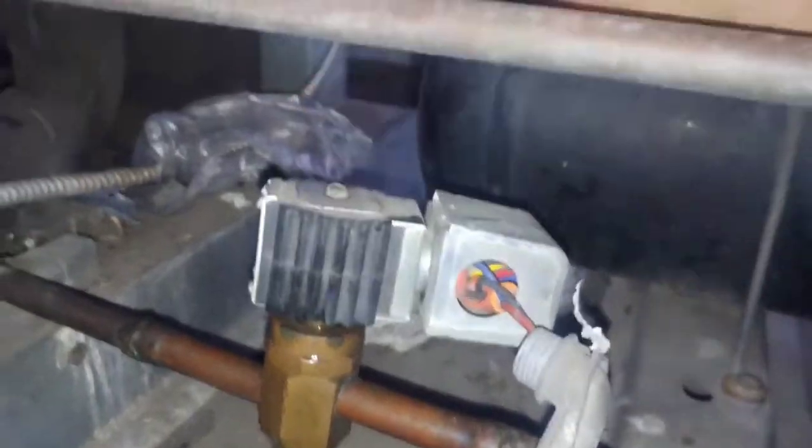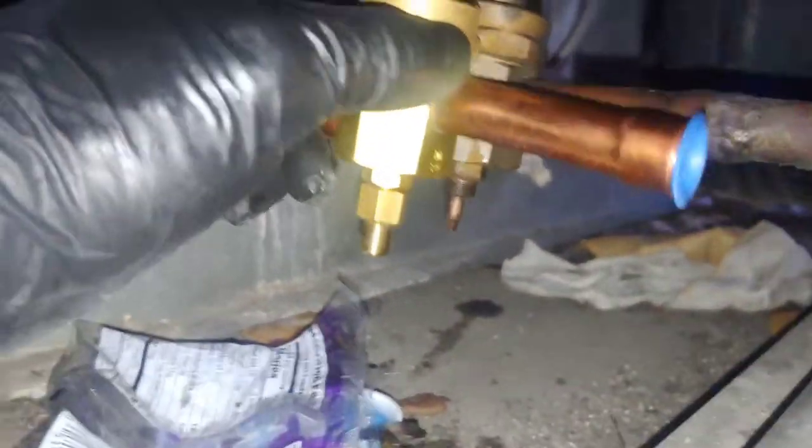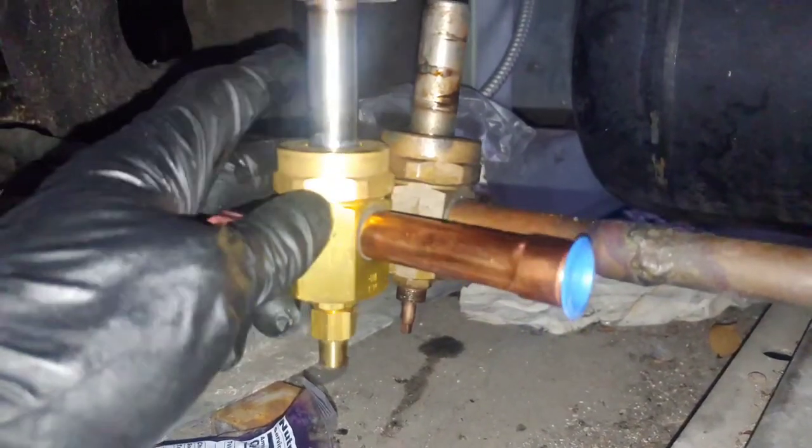Okay, now down here, take off the solenoid valve coil. It's got a 5/16 on top of it. Then before you cut out the old one, make sure that the new one you got is the same: same diameter copper, same top. This is an MKC2 coil. There's an MKC1 that's much smaller diameter, and it won't work on an MKC2 or vice versa. This one has the manual valve, except this one has a cap. That's good. These are actually both the exact same. They can disassemble them with the cap, which we're going to do in a second.